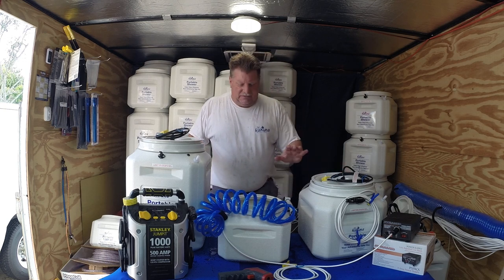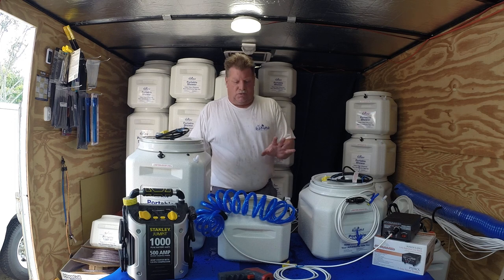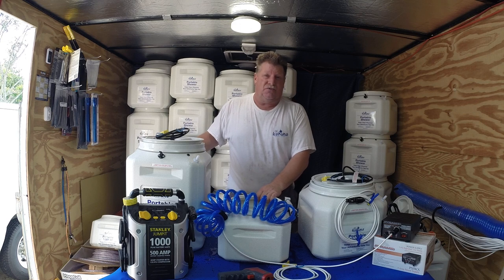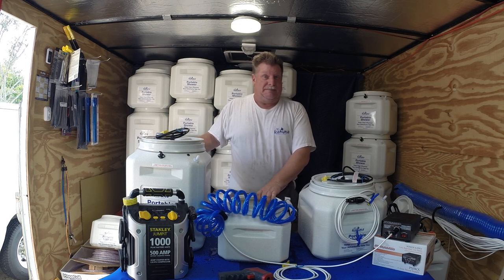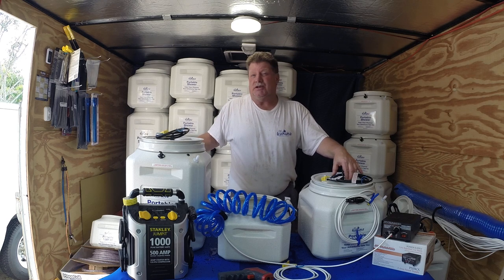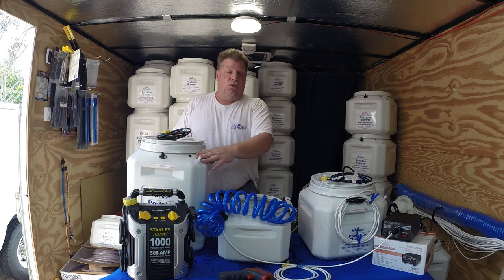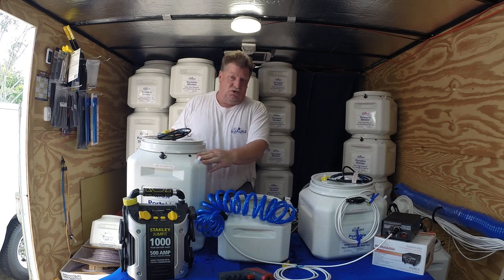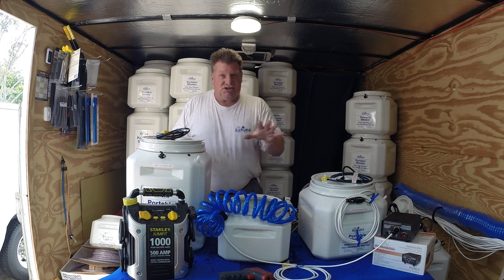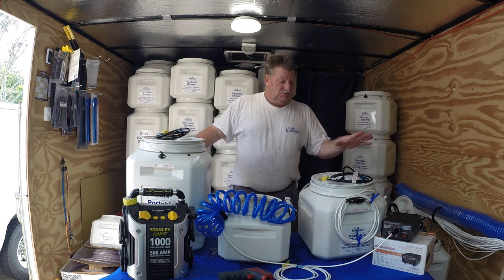As far as heating times go, you're probably starting with water in the mid-50s. The 4.7 gallon will heat water up to about 104 degrees in about 15 to 20 minutes. The 8 gallon will reach those temperatures in about 30 to 35 minutes. The 13 gallon unit will take 45 to 50 minutes to heat water that hot — but then you have 13 gallons of water. The best option for the heater is the 8 gallon.